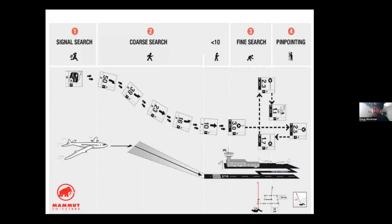And of course, modern beacons have 3 antennas, but it really is the long antenna, the X antenna, that affects the range of the beacon. The other antennas are more helpful in terms of accuracy. So when long antennas are in line with each other, you're going to achieve the greatest possible range. And when those antennas are perpendicular to each other, you're going to have the worst possible range.